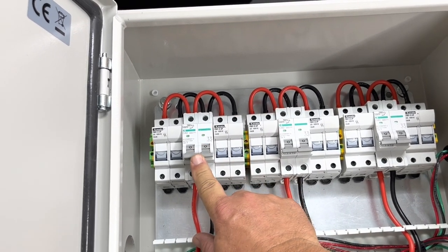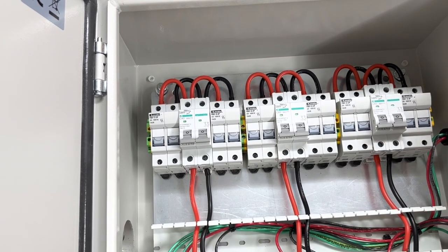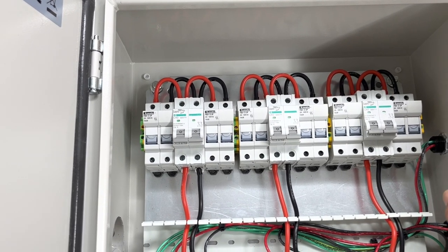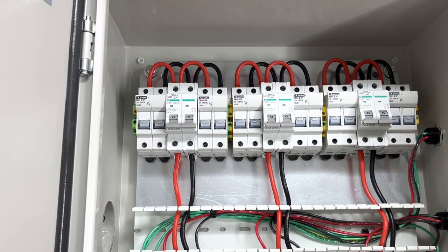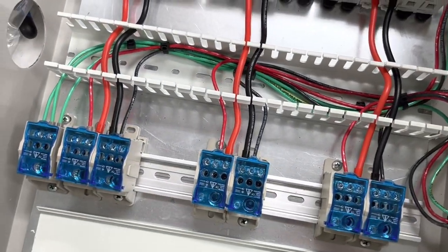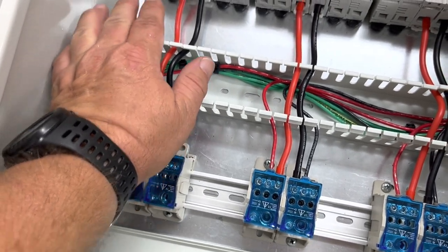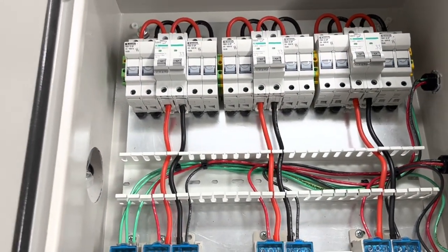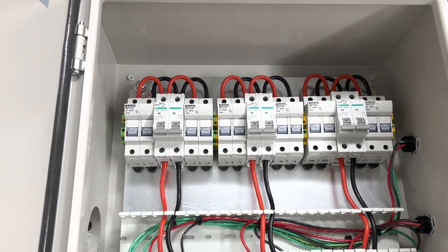These are 40-amp breakers. The short-circuit current is a little bit higher than the maximum power point — I can't remember the exact number now but I calculated it all up. My PV array wires will come in through a two-inch conduit and then I'll peel them off to each of these sets of fuses, so I'll have a total of 12 wires coming in from my PV array and landing here.